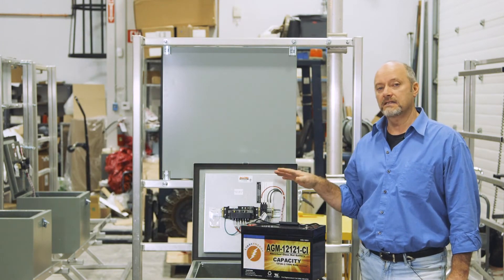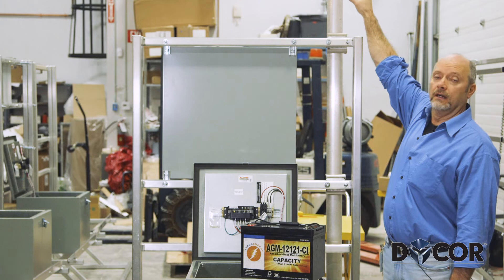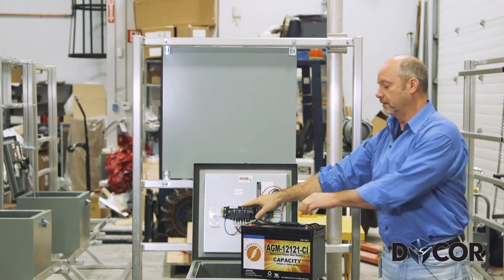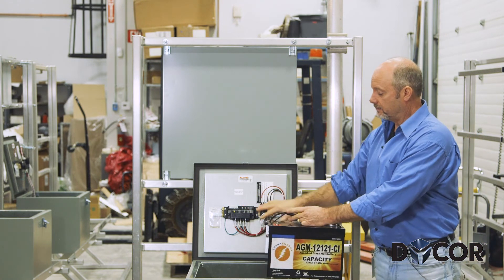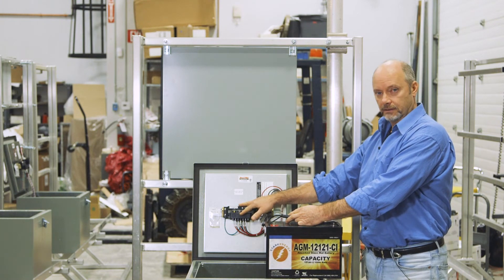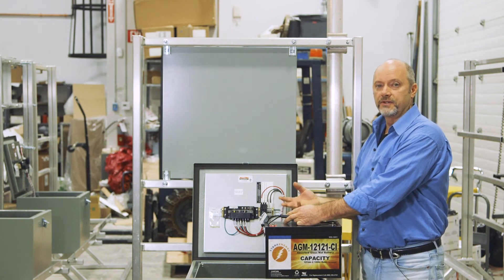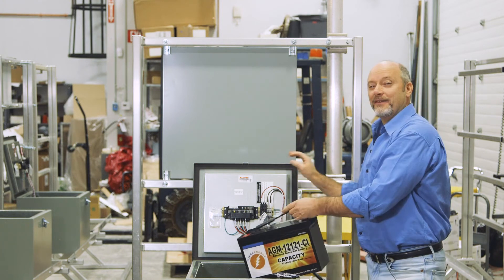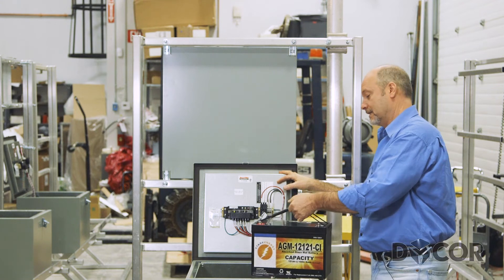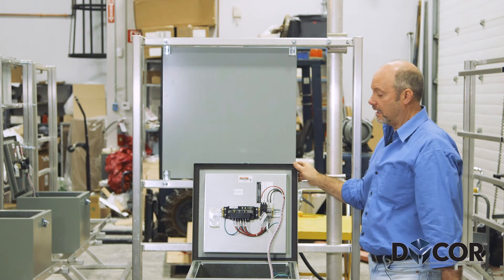On the back side of this stand is our solar package. You'll have your solar panel mounted on your aluminum mast, powering up a solar charger here which regulates battery voltage. When the battery depletes, the sun saver kicks in and charges the battery. You have portable energy storage on your site. The batteries are stored in an insulated box for the Alberta climate — it's an inch and a half insulated box, and it's Class 1 Div 2 rated.